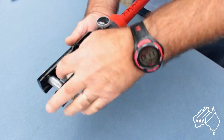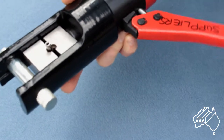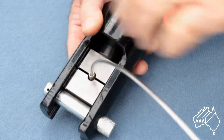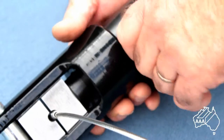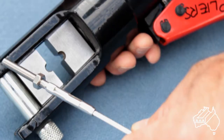To secure the wires to the studs, begin by turning the pump valve on the mini hydraulic swager clockwise. Place the terminal swage stud into the jaws of the mini hydraulic swager and start pumping until the jaws are just holding the terminal stud. Don't over pump at this stage or you will crush the terminal stud and you won't be able to push the wire all the way in. Push the wire firmly into the swage stud and then continue to pump until firm pressure is applied. The faces of the jaws do not have to touch to create a strong crimp. Turn the pump valve anti-clockwise about a quarter of a turn and allow the pressure to release. The jaws will come apart and you can remove the swage stud which now has the wire firmly attached. When done properly, the tensile strength of the crimp should be approximately 800 kilograms. You should check the shape of your crimp against the test sample crimp supplied with the mini hydraulic swager.